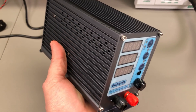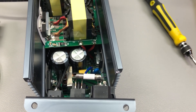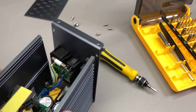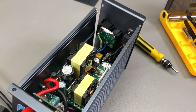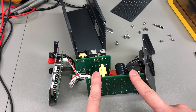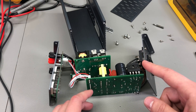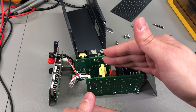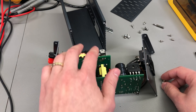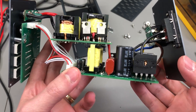Now let's do a teardown. It looks like they have split the power supply section into two boards, and they still have the third PCB for the front panel. Even though it could be very similar architecture to the previous models, it just feels more complex because of the two-board construction. This could easily double the assembly time in the factory, because workers now have to put in two layers of boards, solder them together, and then put in lock washers for each of the active devices that screw to the sidewalls for heatsink capability.